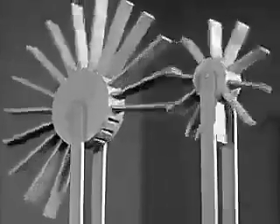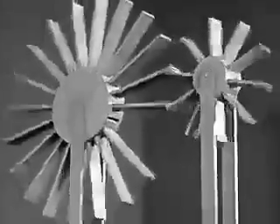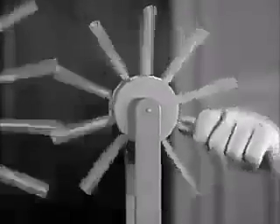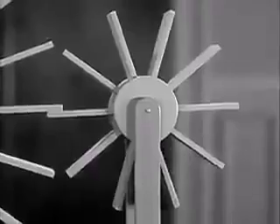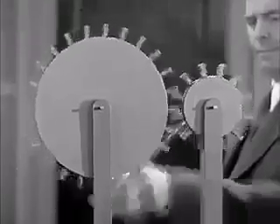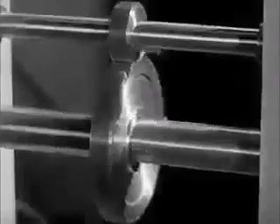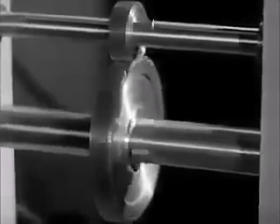The larger paddle wheel makes fewer turns, but it delivers more force. A paddle wheel is nothing but a never-ending series of levers. We can make the wheels stronger and lessen friction where the wheels touch each other by rounding off the edges and shaping them into teeth that will slide in and out smoothly. Now, the power flows smoothly and continuously through the spinning leverage of gear wheels.